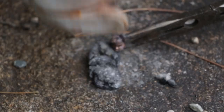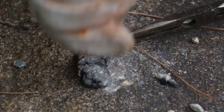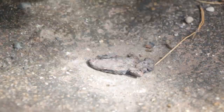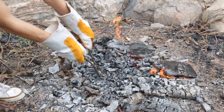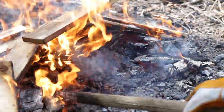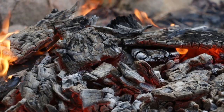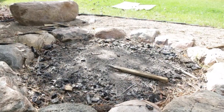The flattening became pretty boring and laborious as I continued on. Though each blow does move some molecules to the side, it is hard to notice that the blows are even doing anything when you are actually doing it. But regardless, you must continue. I heated this nugget in the fire for around 10 minutes before hammering it for about 5 minutes. I am sure a hotter fire would have worked better, though this small fire was working alright. At one point I lost the nugget in the coals of the fire and had to take apart the entire fire. This made me wonder if the old guys would have lost a few nuggets in their fires. I eventually found the nugget and kept hammering.